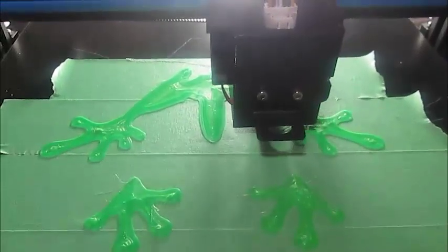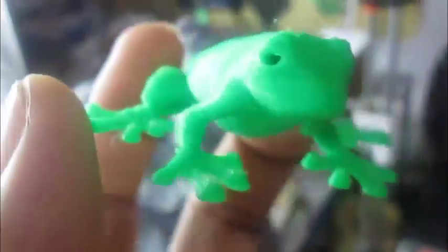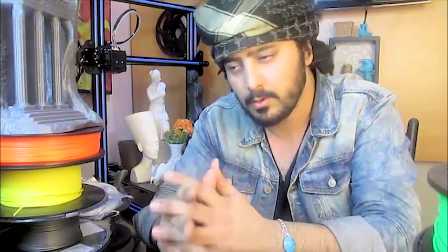Next I printed with some PETG filament and got my first layer adhesion problem, which resulted in a failed print. Though I was able to get a really neat and decent print of this frog model with only minor and almost hair-like stringing. I also printed with some exotic biodegradable filaments like coffee, hemp, beer, copper, and wood — and the printer had no issues handling those kinds of prints, which tells us the versatility of the printer.